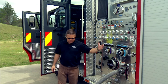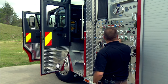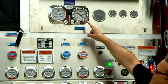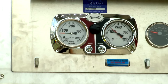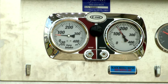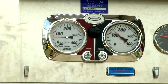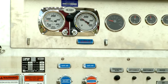Now the pump is engaged. We're going to go ahead and engage the air compressor. Now we've got a green light and we're making air — so that's when we go to auto. If I increase the water pump pressure it's going to increase the amount of air. You see that? Now the air pressure adjusts and goes along with the water pressure.